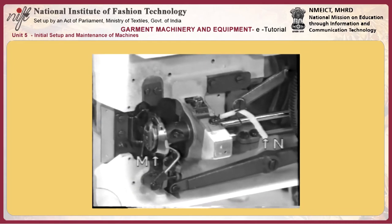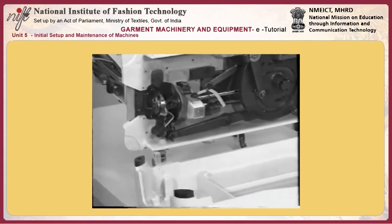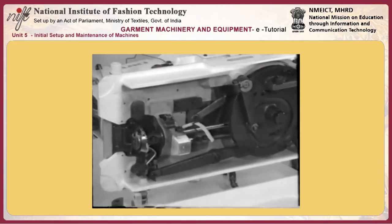Attaching the top cover. Attach gasket R and S in position, taking care not to bend them. Place the top cover and pound in 2 knock pins D.